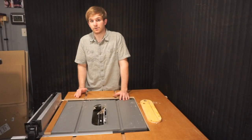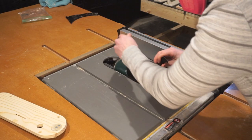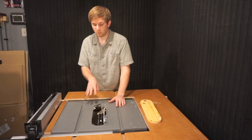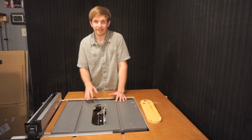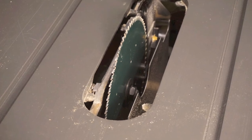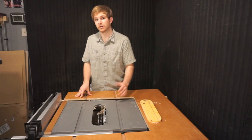While we're here, I'd like to talk about the arbor. The arbor is what the blade rests on, and blade changes are super easy — it comes with two wrenches to get that done. One downside to this table saw is that the arbor isn't long enough to house a dado stack, even a thin one, even like an eighth-inch one. It's just not long enough to put any more blade thickness on there, so keep that in mind when considering buying this model.